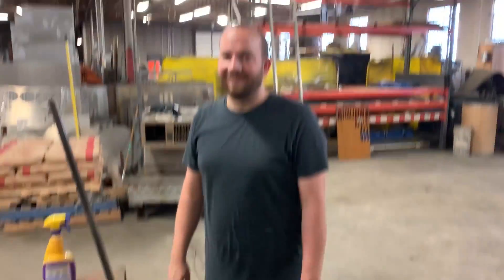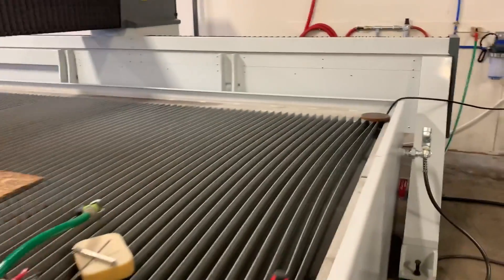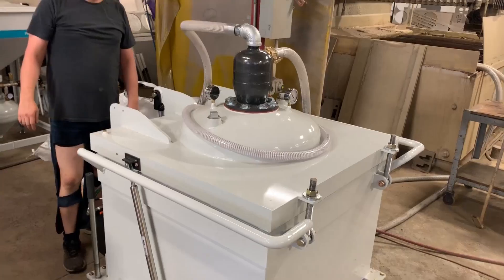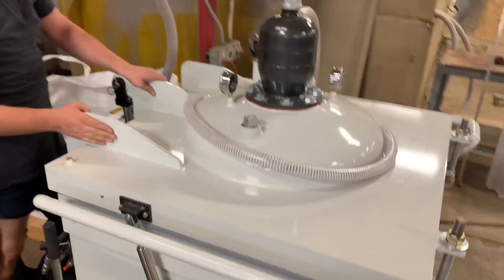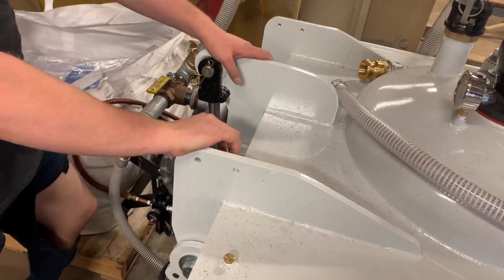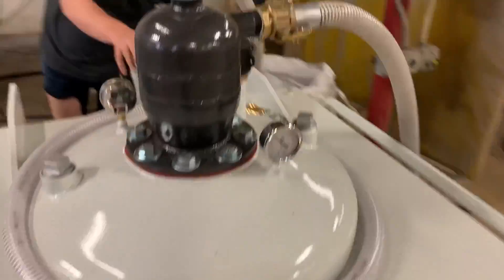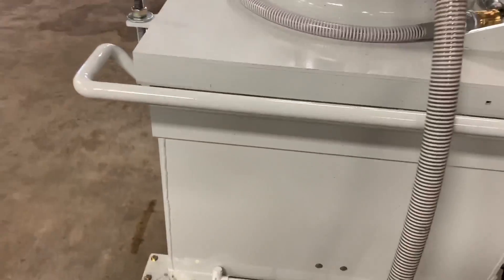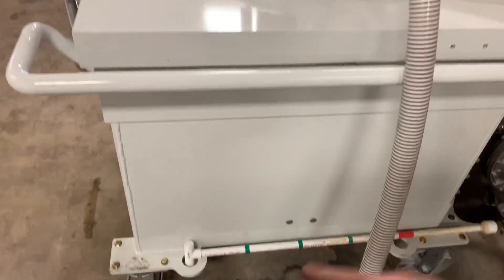On this one, if you watched the install video, we've got a lot more slats going that way with pillars welded to the bottom holding them up, so we can't really scoop this one out. We got one of these things — it's called an extractor, the company is actually called Extractor. It sucks water up one hose and spits it out the other, and all of the garnet and sediment gets trapped in a box. It just pumps the water back.